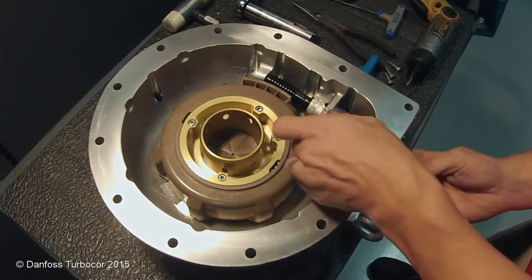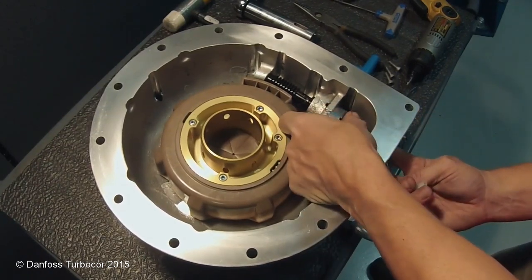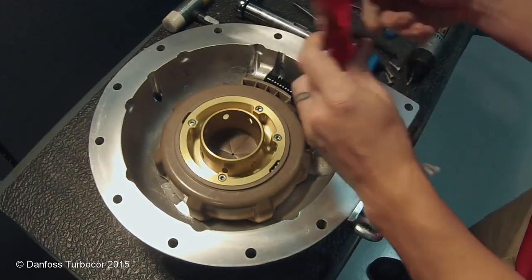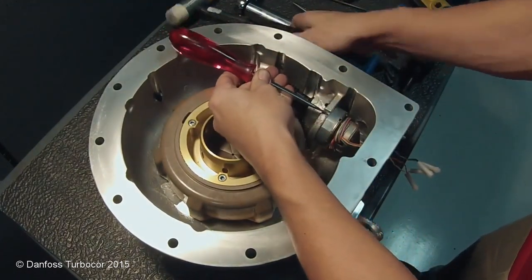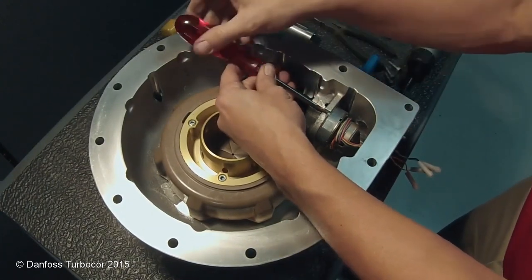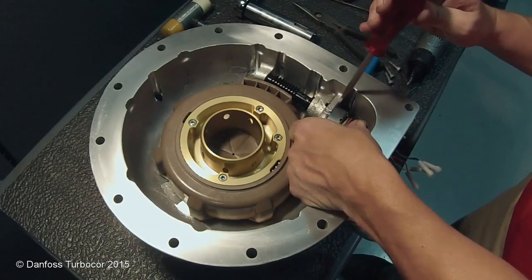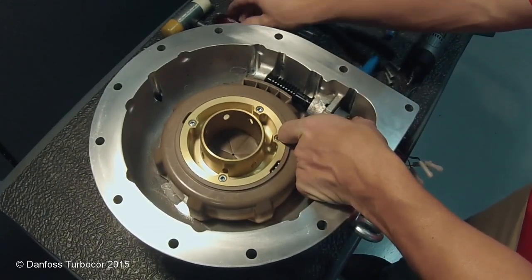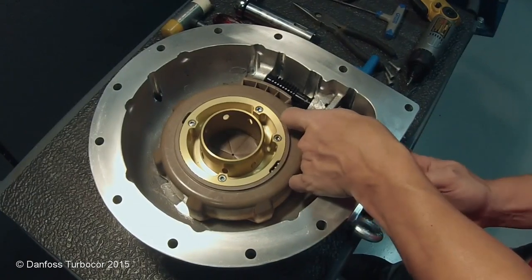While supporting the bottom of the motor, pull the motor shaft straight out from the worm gear. Do not force the motor. If the motor shaft does not easily slide out, tap the motor on the locating screw to free the shaft from the worm gear. A flat screwdriver can assist prying the motor out while supporting it at the bottom to pull straight out.